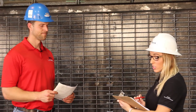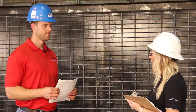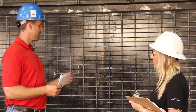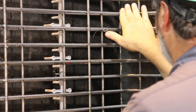Next on our inspection checklist is a visual inspection of the welded wire reinforcing condition. We need to make sure it's clean, there's no form oil on it, and no excessive rust — light rust is acceptable. We also need to verify the reinforcement isn't dirty and there's no pitting, gouging in the welds, or undercutting. This wire came straight from the supplier, so it's very clean. Whether from a supplier or in-house, definitely check the reinforcing before placing it in the product and make sure there's no form oil so you have good adhesion. Look out for pitting or excessive flaking rust.